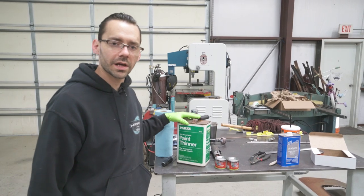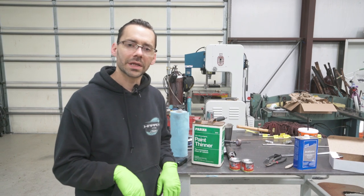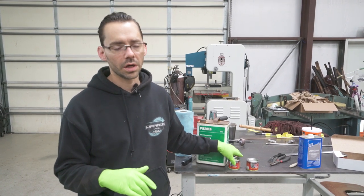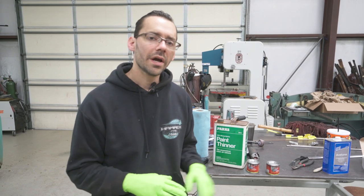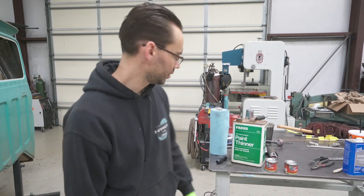Okay, we're gonna clean the inside of the big back window cab. Now that we've got the rust stripped off of there, we got most of it stripped off, we got the loose stuff knocked off. So now we're gonna use some Por-15, which is how it's designed to be used: over not crusty rust and not necessarily bare, clean, perfect metal, but knocking the loose rust off as best you can with a wire wheel, and then coat it with some of this Por-15, and that'll preserve the inside of the cab and prevent it from further rust. So first we're gonna just clean it with some paint thinner, with some rags, make sure you got some gloves on. We're gonna do that a couple of times, and then we'll start painting it, and we'll let that set overnight. And then tomorrow we'll install the big back window panel that we've been prepping and fitting.